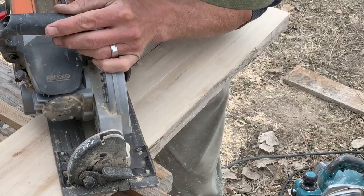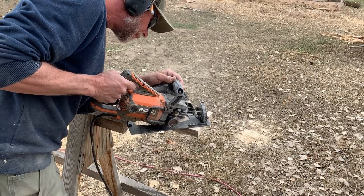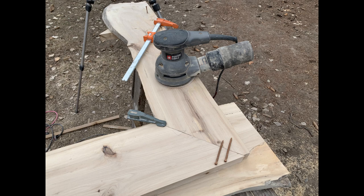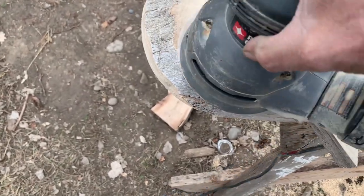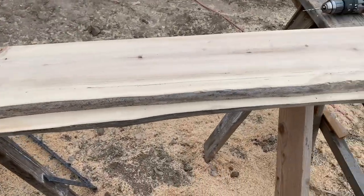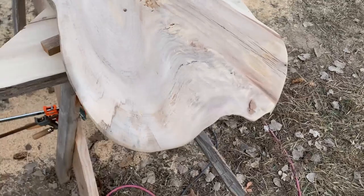After squaring off the two legs, I put the miter on both sides of the back section of this shelf so that I could overlay it directly on top of the two legs, square up the corners, and transfer the marks from these miters onto the leg pieces. Here we have it laid up — you can see where I clipped the corners of the legs. Then I use two screws to anchor the corners. With everything mocked up, I can come in with a random orbital sander and get everything smooth and sand down those miters so they're nice and flush. All sanded, ready for oil.